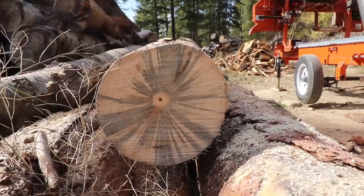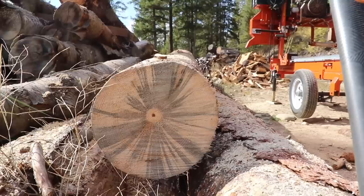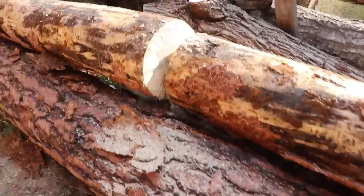Because we have a fir timber frame, we're not looking to use blue pine as accent wood in the house yet. It doesn't make sense to deck all this wood and have a huge pile of logs sitting unused while we go cut other trees for the lumber we need. So we're going to cut this stuff up — as long as it's solid wood we'll use it for the interior wall lumber. We're building a timber frame ICF SIP house and the interior walls won't be structural, so stick framing them is the fastest and most efficient approach.